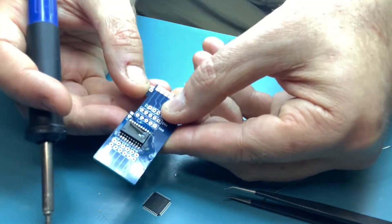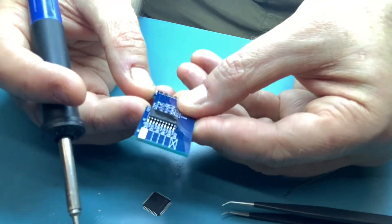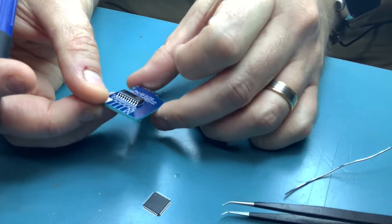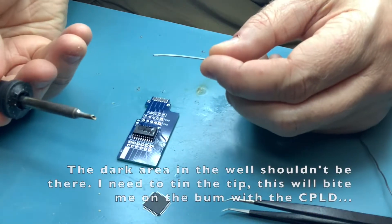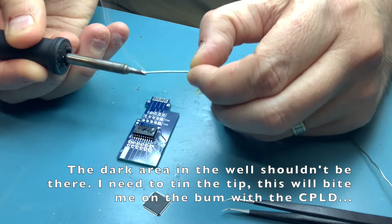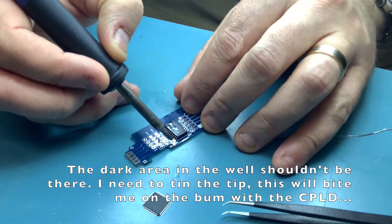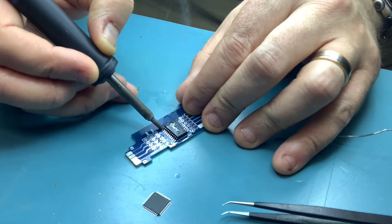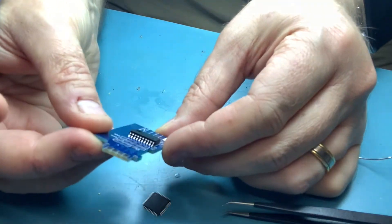Both sides are done — that was really easy. Now when it gets a bit trickier is with stuff like this CPLD — 10 nanoseconds — which has very fine pitch between the pins. The exact same method still applies. Get some flux, make sure we align it the right way. Highly recommend you clean your tip very frequently and re-tin it. Put a bit of solder on the corner pad, pick up the QFP with tweezers, then maneuver it with your hands.